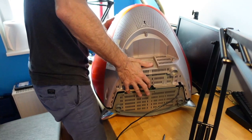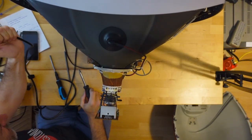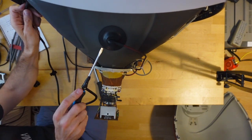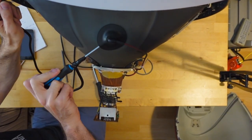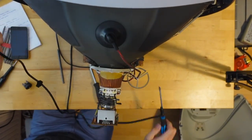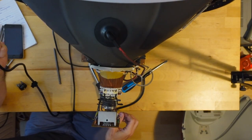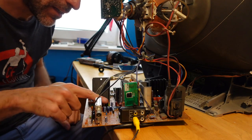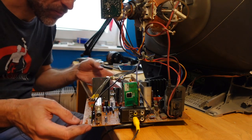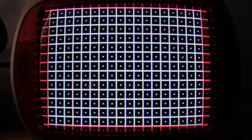Time to open up the case. Thankfully it was just five screws and I got easy access. First thing I'll do is lift the anode cap and use my discharge tool to remove any leftover electricity. If you're going to carry out any sort of CRT repairs yourself, please read up on how to do this safely - Steve has an excellent video that I'll link in the description. Inside the monitor it was very clean, surprisingly, because I needed to clean the outside with household spray. All the caps looked just fine, and given the geometry is already pretty great, I don't need to do any internal servicing here.